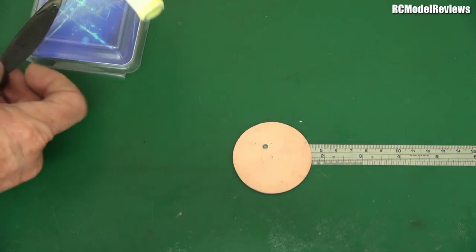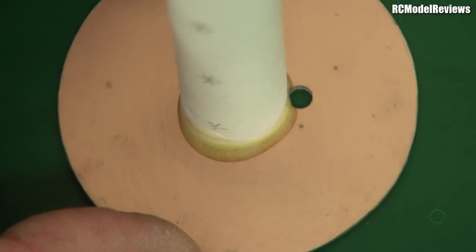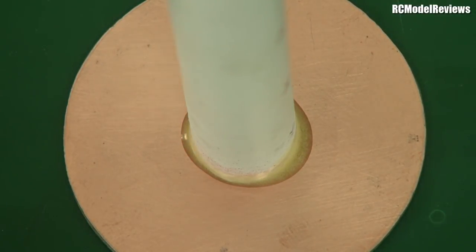In hindsight I'd make three or four concentric rings a millimeter or so apart on the reflector, so that even if glue covers the inner ones you can see the outer rings and get it centered. I'm pretty sure it's close enough - this whole build is to prove you don't have to be sub-millimeter accurate to make these things work. Leave that to cure, then we'll put the wire on and start soldering.